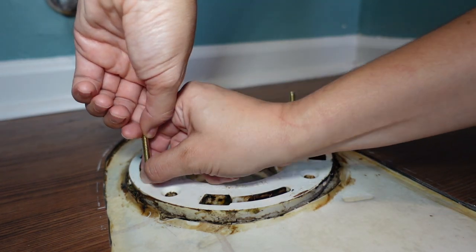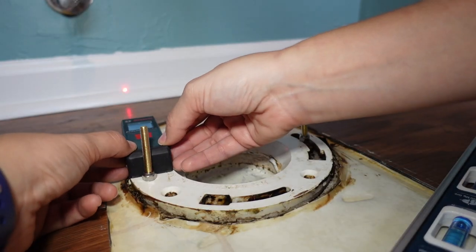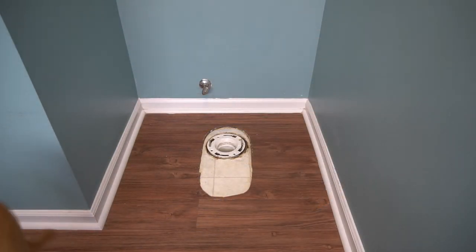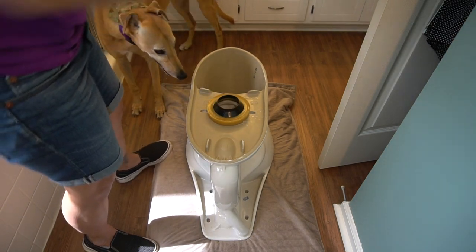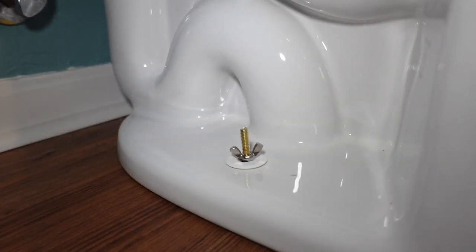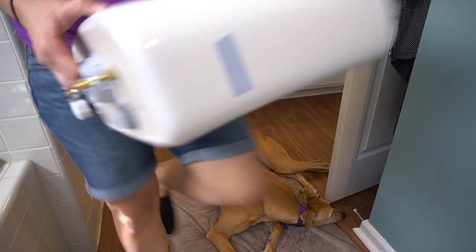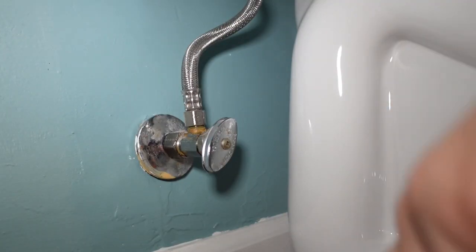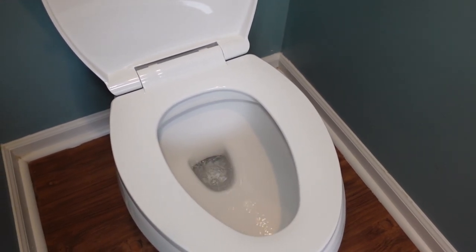The new toilet came with new nuts and bolts that we placed inside the floor flange, making sure they were perpendicular to the wall using a laser measure. Just a warning — your dog will be very interested in all the new smells, but it was way less smelly and messy than we originally imagined. We put a new wax seal on the bottom of the toilet, placed the bowl right on top of the bolts, leveled it out, and secured it with the enclosed wing nuts and caps. We brought the tank in, prepped the bottom, put it on the bowl, attached the water supply line, added the seat with lid, turned on the water, and flushed — success!